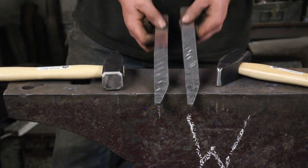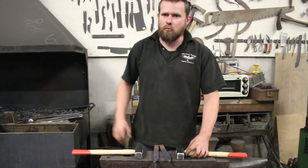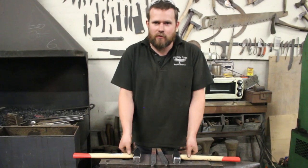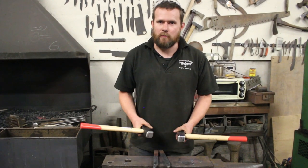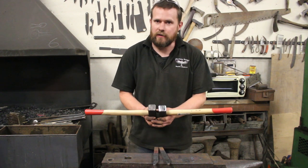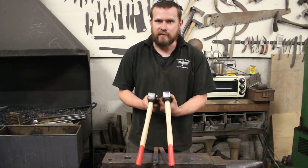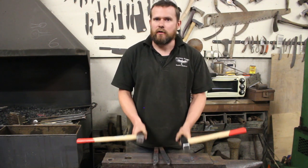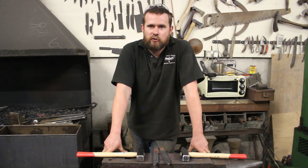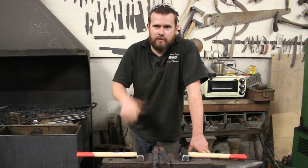It's really important when you're buying a new forging hammer — it doesn't matter if you buy it from Walmart, Tesco's, wherever you're getting your cheap hammers from — they'll all do the same job as the hammer you've just spent 200 quid on. With the little addition of five minutes on the linisher to dress those faces it makes a world of difference. I hope you've found this little tip helpful, and if you enjoyed this click like and subscribe — we'll see you next time on Born to Forge. Cheers guys!